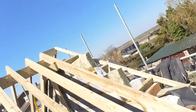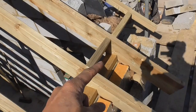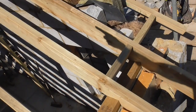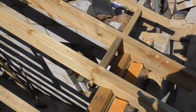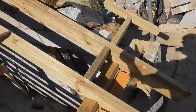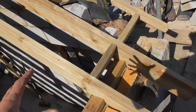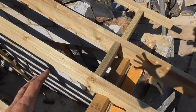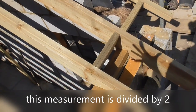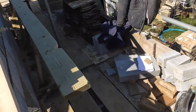So simply what I've done here, as usual, as you might expect, I've taken the outside plate to outside plate measurement, and I also know the drop - the difference between that plate height and this plate height, which is 390mm in this instance. I've put that measurement into my rafter calculator, I think it was about 5m 70 or 5m 90, and it's given me the length of the rafter.